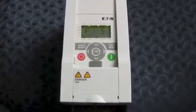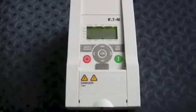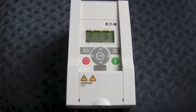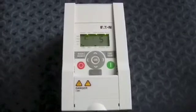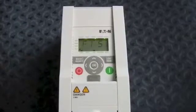This will be a quick tutorial to show how the MMX VFD, which is used on the Atom simplex pump systems, records and stores the fault and alarm logs. Right now you can see the display is flashing a present fault.